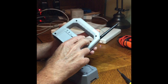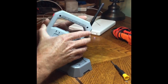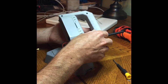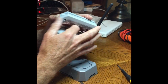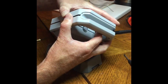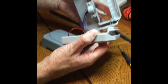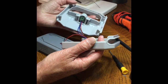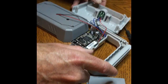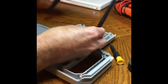This is like a clamshell case, so we'll take this apart to give us much better access to this connector. With those four screws removed, we're going to have a moment of truth here — this is oftentimes where stuff comes flying out, or springs come popping out. Hopefully we won't have that. It looks like the antenna wants to kind of fall down, but it just folds out in half. Pretty simple. This is our existing antenna that we're going to replace — you can see the difference.